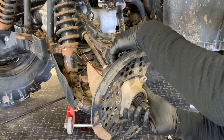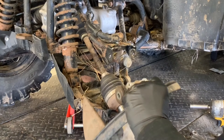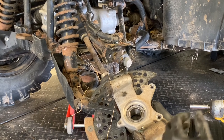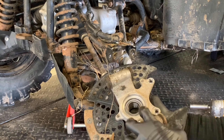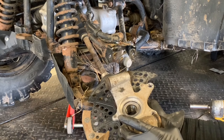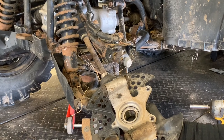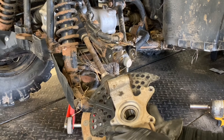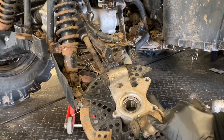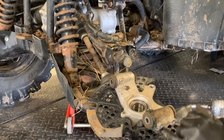Now we have our carrier that's going to slide off of here. You might have to tap on that axle so it slides out of those bearings. We've got our carrier off — you can see these spacers that keep falling off; they're full of dirt and debris. What happened is these grease fittings got completely packed with too much grease, which squirted out everywhere, causing dirt and debris to stick to the spacers. There's actually a seal behind this spacer — if you put too much grease in there, it'll ruin that seal and allow dirt and debris to get in. I like to do about three or four pumps when they're new; if they've already been packed with grease, two pumps will be enough.